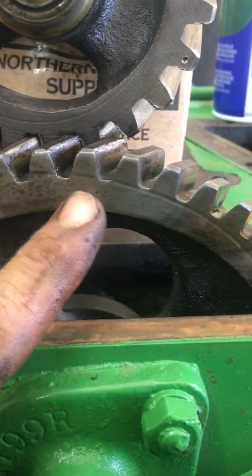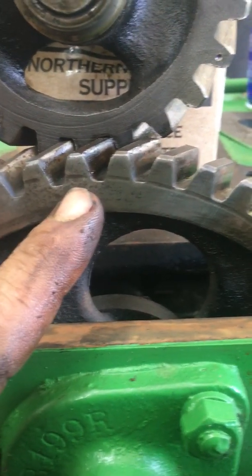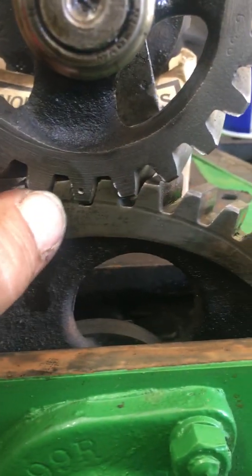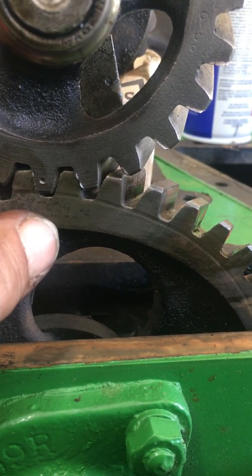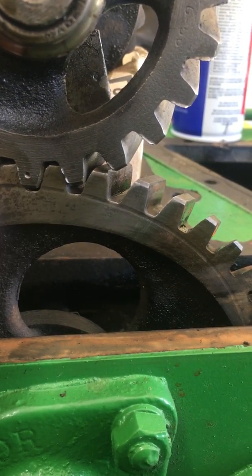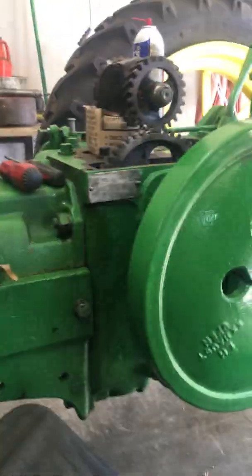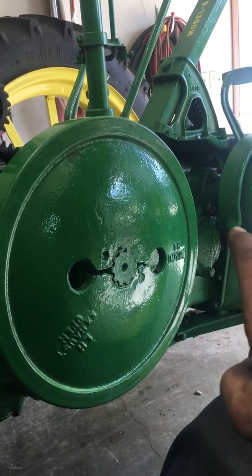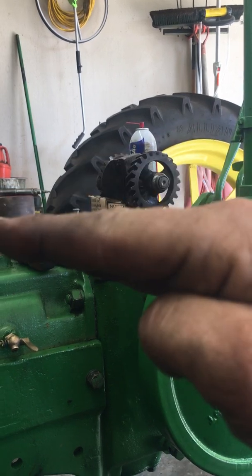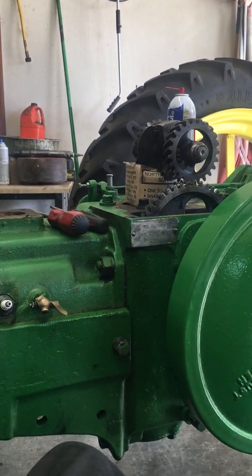So that's where I stand as far as the timing marks go on the camshaft — on this one there are no marks, and that would throw a lot of people off or scare them. But it doesn't matter. That timing mark on the governor is there. I don't know why it's not on the camshaft, but I'm going to put it there for the next guy. As long as you're on number one top dead center with LH impulse and the flywheel lined up to the mark on the main case, the governor coupling drive should be sitting horizontal. Hope that helps. Take care.